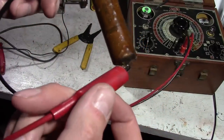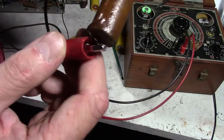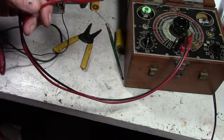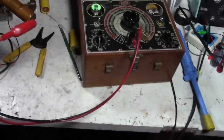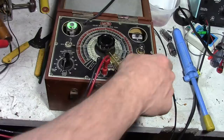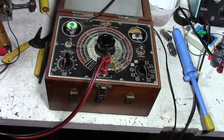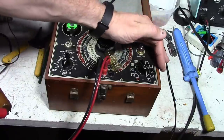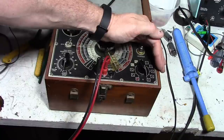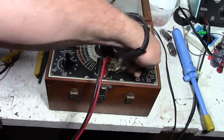Here's the ooey gooey 0.005 microfarad 6,000 volt cap I took out of the set. Now this tester only goes up to 500 volts, but I thought for the heck of it, let's see how it does. So let's go all the way up to 500. Huh, and look at that. It's leaky at just 500 volts. And no doubt at 6,000 it's going to be way, way, way leakier. So